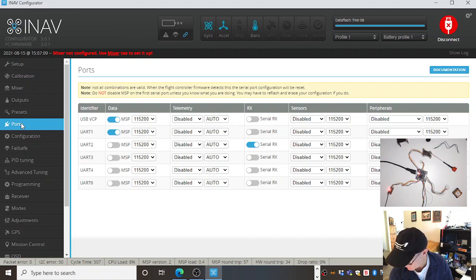Now, there's a lot of argument about whether that's legal or not, but officially that's what I've heard, so that's what I'm sticking to. So we could bump this up from 25 milliwatts maybe to the next one, which is 100 milliwatts of power, and then 200 milliwatts, and then so forth. No way would I be putting, this little video transmitter can't go to a watt anyway, but it certainly can go to probably 400 milliwatts. Remember, double the power, like from 200 to 400 milliwatts, is not double the distance, and that's a whole different conversation in itself.